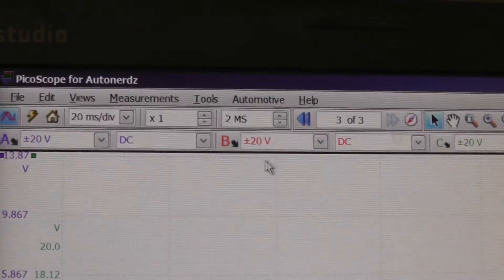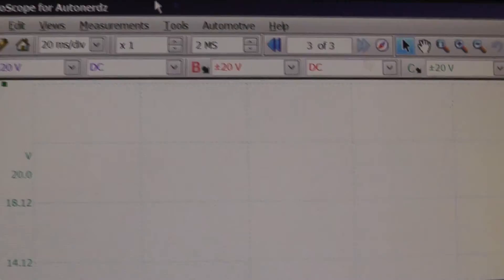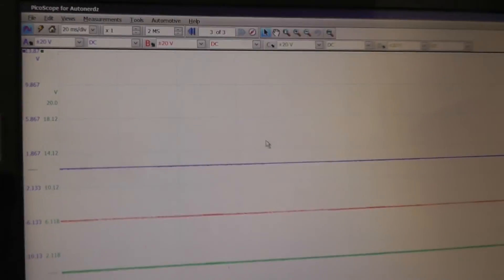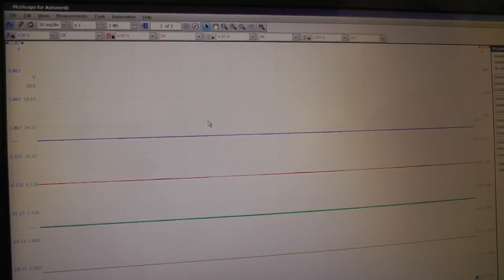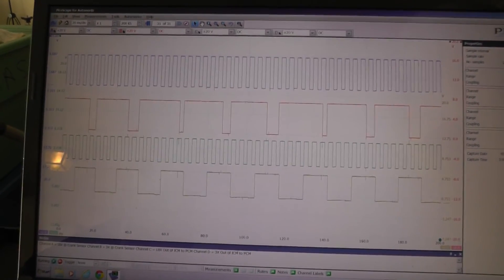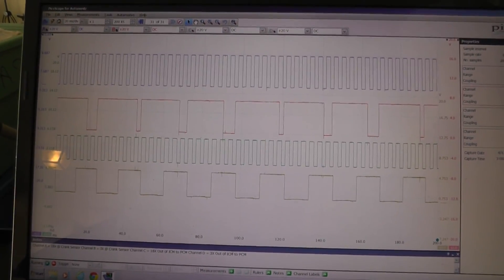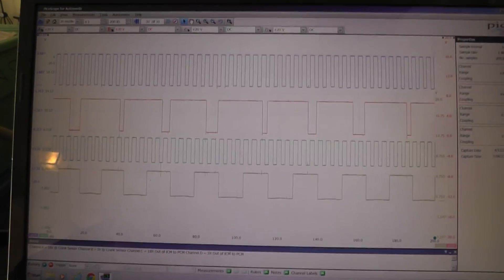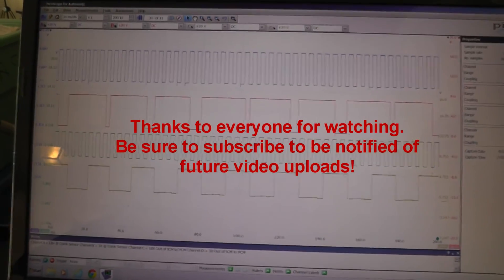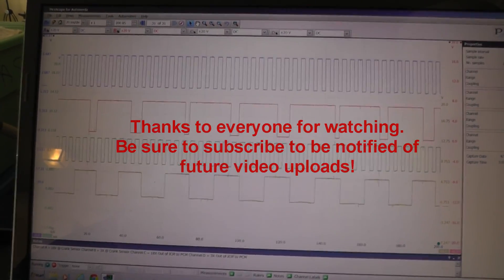I've got this set to 20 milliseconds and plus or minus 20 volts across all channels, although we're probably looking at roughly 6-volt signals so the exact settings aren't critical right now. We can see the four waveforms from the points we picked out earlier. It's hard to see on camera, so I'm going to record the desktop, add annotations, and in the next segment we'll analyze these waveforms and talk through what they mean.